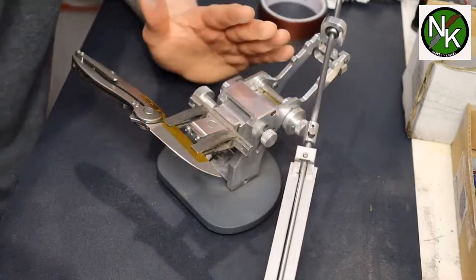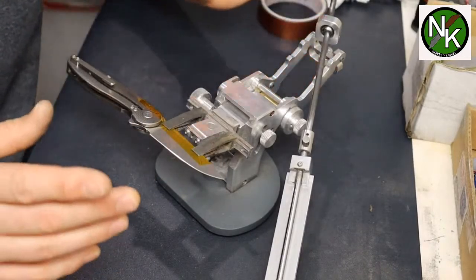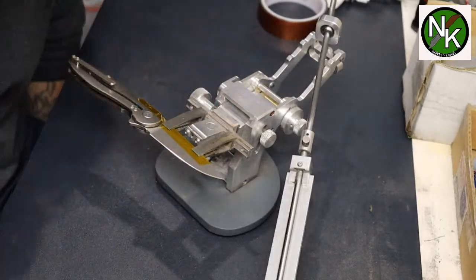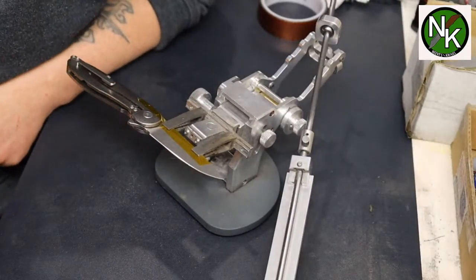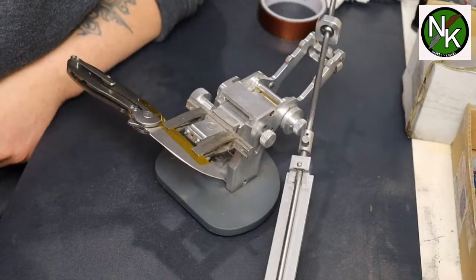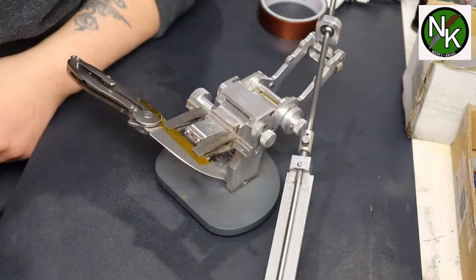So this tells me something too, by the way. This tells me that this S35 probably isn't a really high HRC, which a lot of it isn't, right? But my saying that isn't completely towards this S35. It's telling you something for all steels. If you've done a lot of M390, you'll have the feel for how good heat treated M390 deburrs. It usually deburrs within just a couple passes, very lightly. Now, if that burr keeps going back and forth, you might know that steel is pretty soft. Maybe it has a lower HRC.